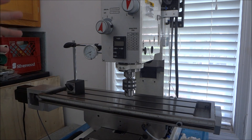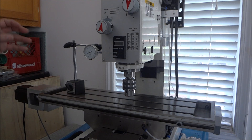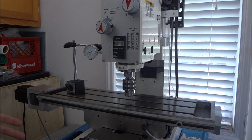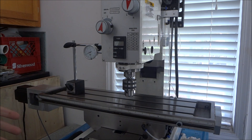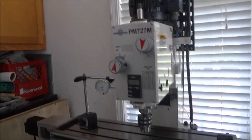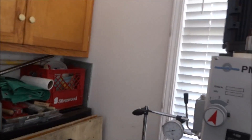I haven't really fine-tuned my adjustments — I just did the initial assembly and got everything working. I did that to see what my initial backlash is going to be just from putting everything together without really tweaking anything. So today we're going to set our steps per inch, and we're going to start with the x-axis.